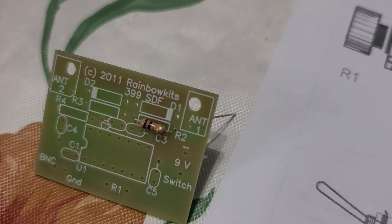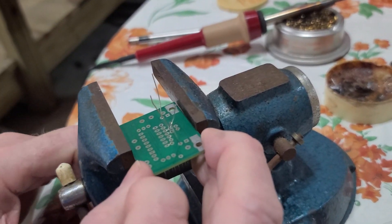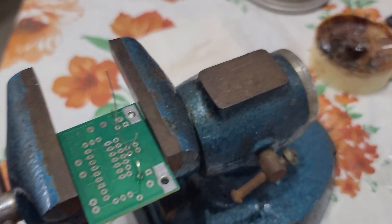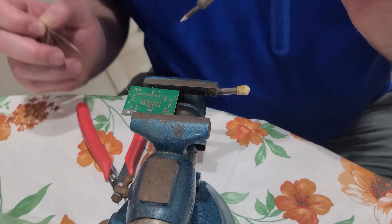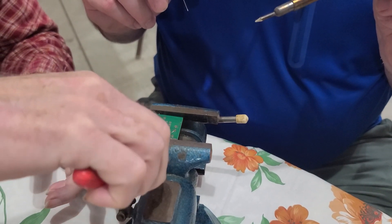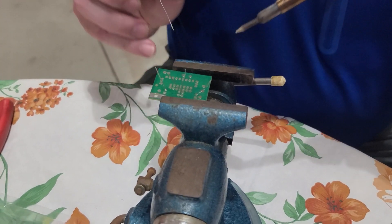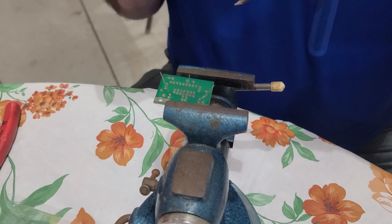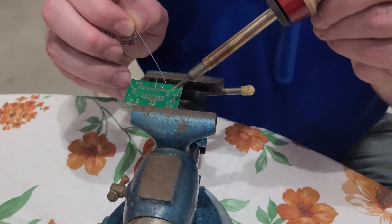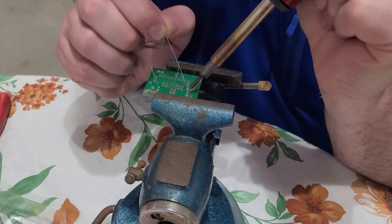It's a small board with not that many components. Now getting into the soldering: you can put a little solder on the tip, then put your tip right down and feed the solder in — watch that baby flow. When it turns to liquid and flows in there, you've got it. That's all you need. It's what we used to call through-hole type components — no surface mount or anything tiny like that. So once those connections are made, the resistor's not going anywhere.